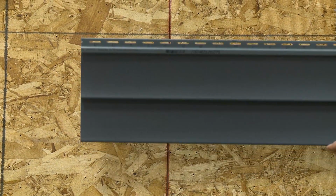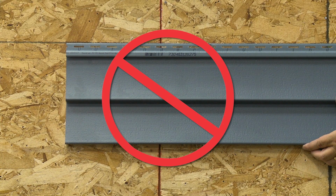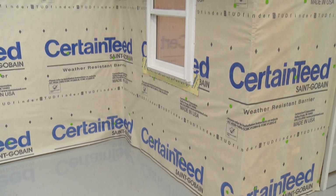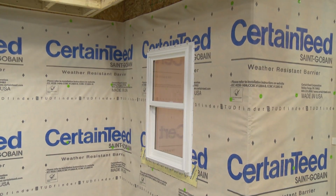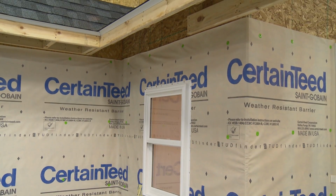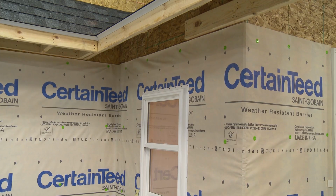Vinyl siding is an exterior cladding. It is not a complete weather-resistant barrier. Before applying siding, make certain the substrate is watertight. In order to be protected from precipitation, the substrate may need to be properly flashed around such areas as windows, doors, other openings, and corners so as to shed water to the exterior. The siding alone is not meant to be a watertight barrier.